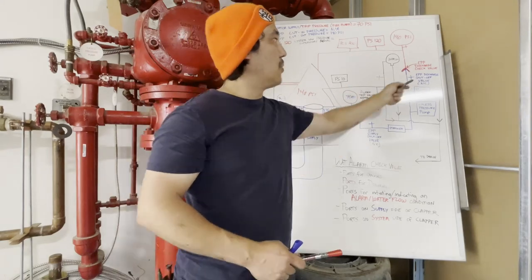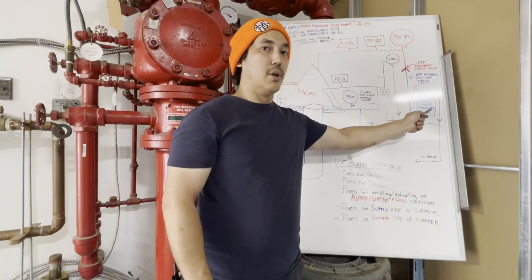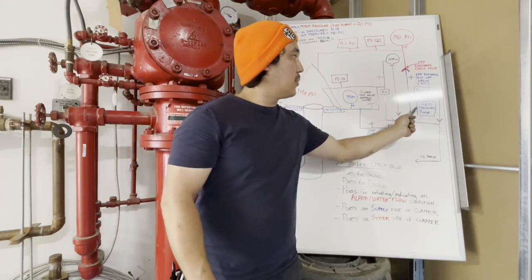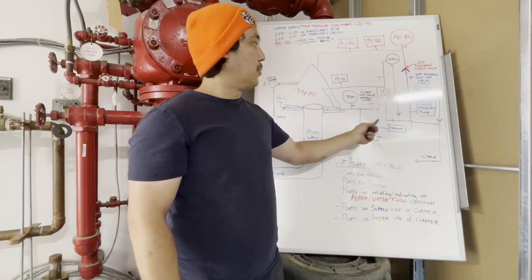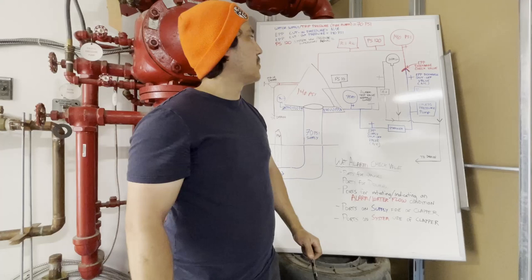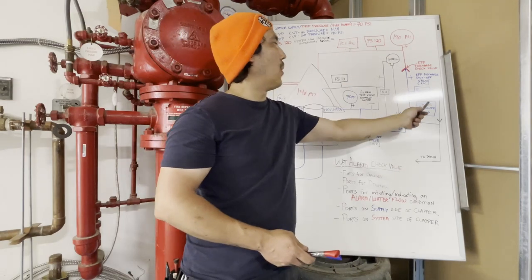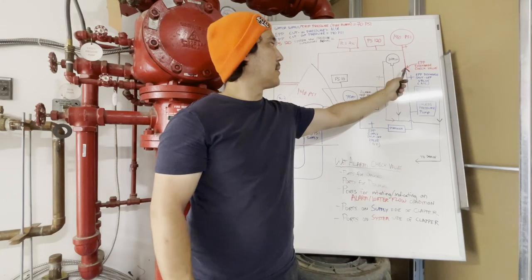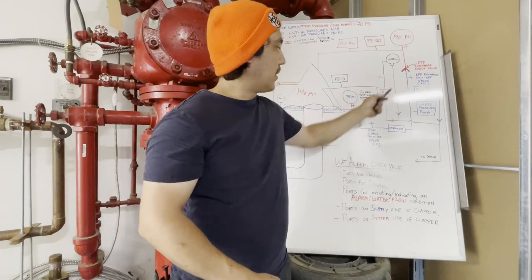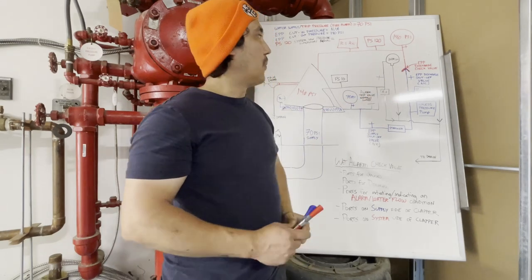Now that we know how that works: for a manual system, we have these three fail safes and we keep the shutoff valves closed — we know pressure is going to be locked in. But once you've installed that PCS 300, you really only have that check valve saving you. For an automatic excess pressure pump, these valves cannot be closed. If you leave them closed, you've cut off the water supply and discharge to that pump, and it's going to burn itself out running with no water in or out. If you at least leave the supply open, the relief valve will let go, but it'll just be dumping water outside. So if the customer wants to switch to automatic, they'll install a PCS 300, get an electrician in, and the discharge check valve must be fixed and holding properly.